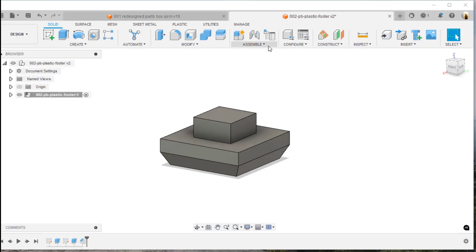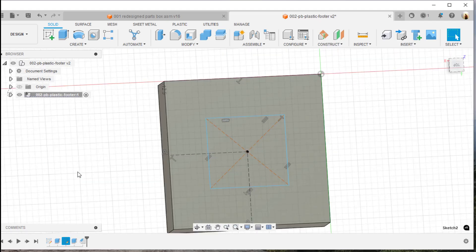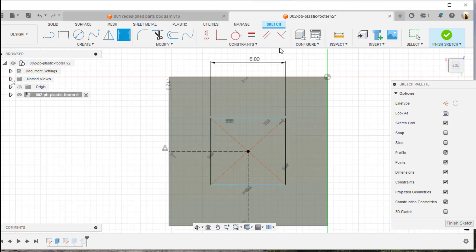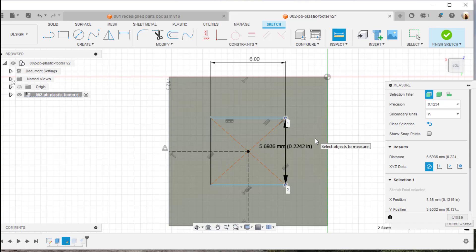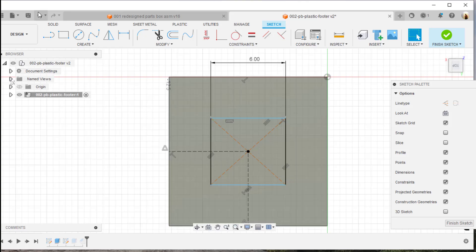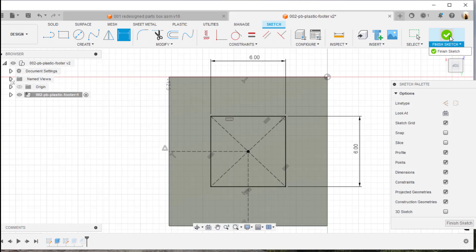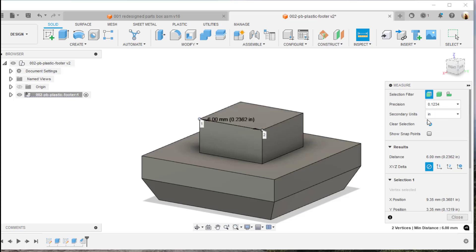After looking at this a little closer, I think I did something incorrectly — the actual shape and size of this tab. I'll come back to the sketch, edit it, and dimension that. It should actually be six millimeters, not 6.35. Let me double-check — I'll measure that... yes, six millimeters. I'll reset the dimensions and confirm — six millimeters. That's great.